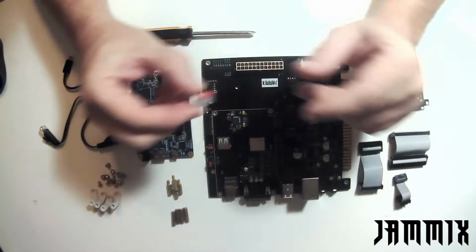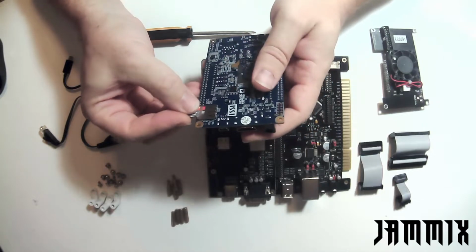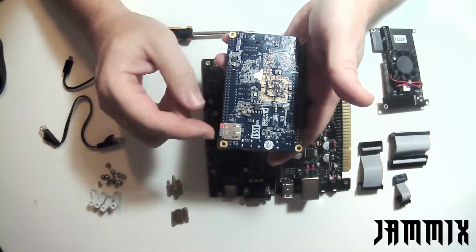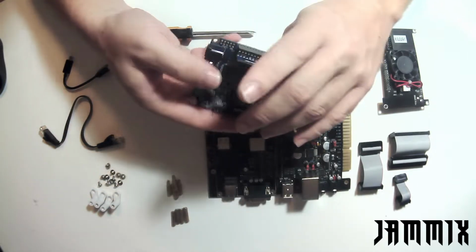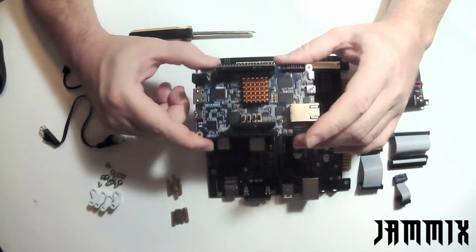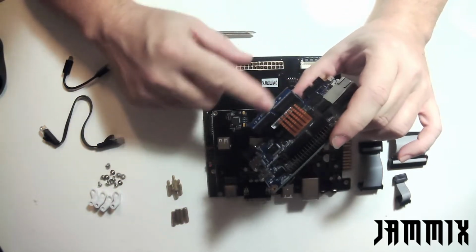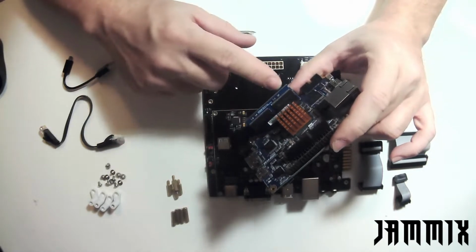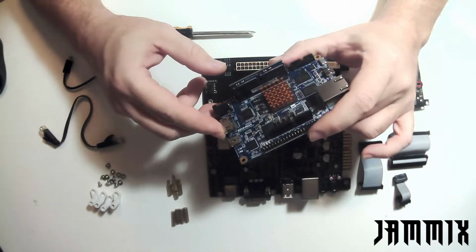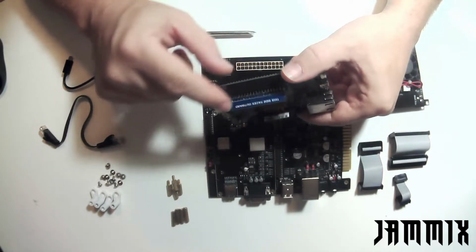And the changes that you need to make to those are also listed in the description of this video. So now that we have our properly formatted SD card, I'm going to go ahead and put it in the DE10 right now, and that's on the bottom side of the DE10. I want to be careful putting it in there because that little connector is kind of fragile. It's also important to point out that the DE10 Nano is not included with Jammix, and needs to be purchased separately. You also should probably pick up a 128 meg SDRAM for it, also not included. You'll need this to play Neo Geo, many of the arcade cores, so it's just a good thing to have, especially since we're doing an arcade build here.